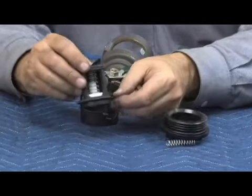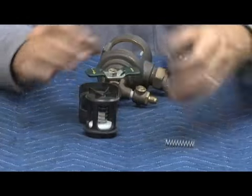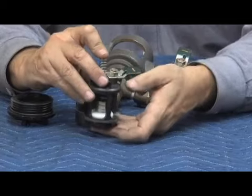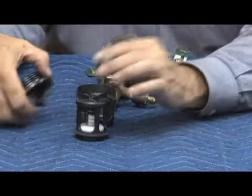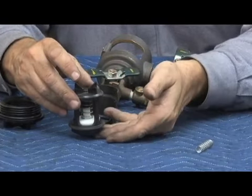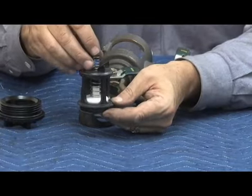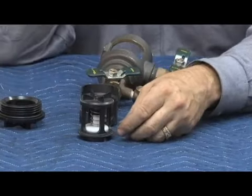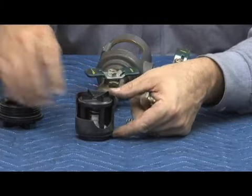What you've got is a diaphragm on the bottom portion of the check assembly. It's a standard check, spring-loaded, and the air inlet sits like this. The air inlet has to have a lower load because it has to close before the check valve is allowed to open — that's the critical difference on an SVB. This diaphragm on the bottom is important because when water first comes in, the air inlet moves up to seal across the top, compressing the air inlet spring, while the check isn't opening. The diaphragm allows that up-and-down movement. That diaphragm is very important because the retainer sits right on the lip of it.